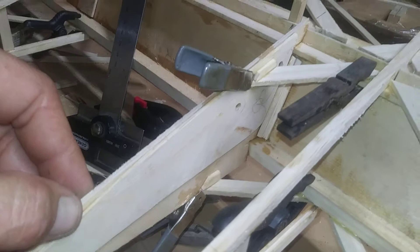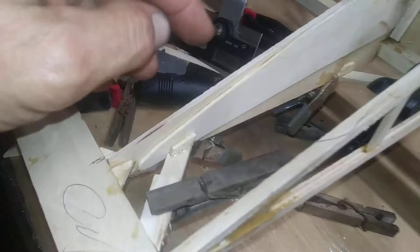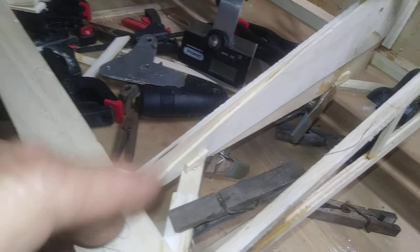It's much easier than trying to cut a slot and then block in where the slot was too big and try to get a piece of geodetic to go the full distance through that — that's a lot of work and very difficult. This was very fast. And based on what I found from those butt joints, which I never trust an end-grain joint, they seem to be pretty strong. I figure with these little blocks in it, it'll be good.